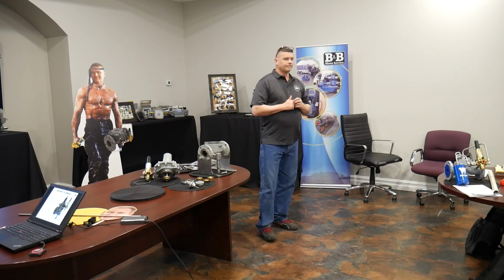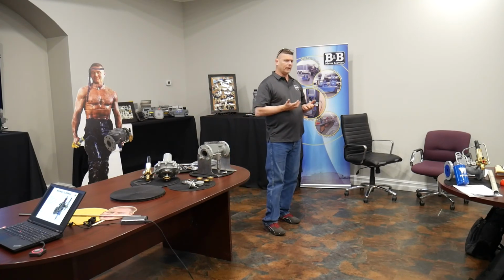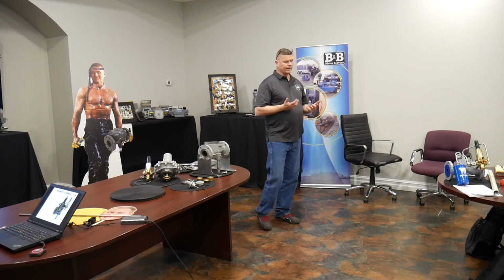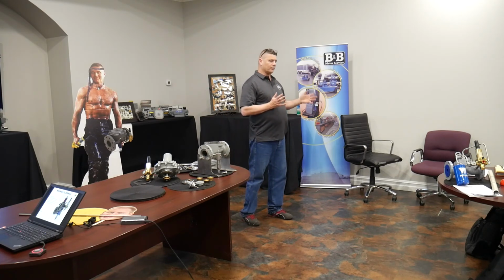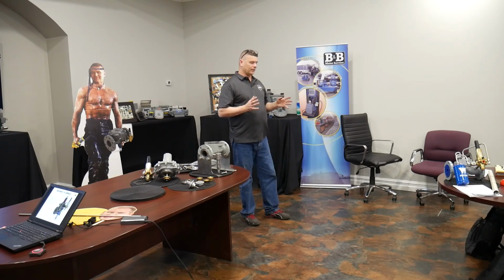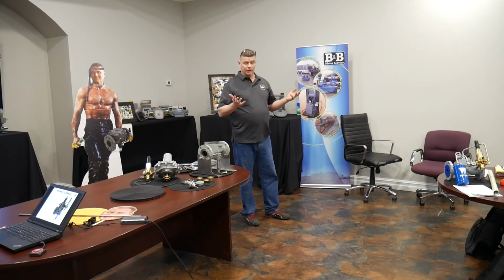Can you flip those up as a working monitor? Pretty rare, just because it's an ANSI 150 regulator. That would definitely be the case with the HPs. But because it's an ANSI 150 regulator, it's not very common to see that people want to make 2 cuts plus have each one back each other up. Usually that's happening when they're wanting to share a relatively large cut, maybe share also the temperature drop due to Joule-Thomson. But it's not something you couldn't do.